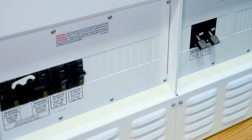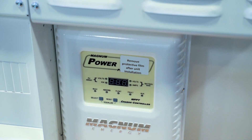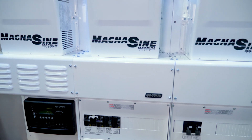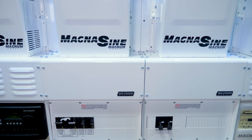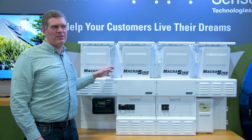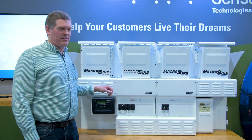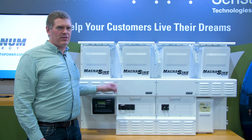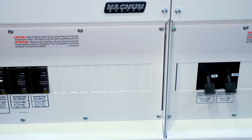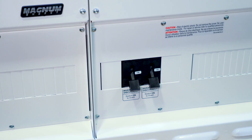This is a non-grid interactive system, designed primarily for off-grid and backup applications. It does offer AC coupling, where another renewable source grid-tie inverter is connected downstream of this system and can provide power or offset loads when a grid or generator source is available. When those sources are not available, the AC coupling is managed through the inverters, which have firmware that permits frequency shift. That frequency shift allows appropriately configured AC-coupled grid-tie inverters to throttle their output and effectively charge batteries.